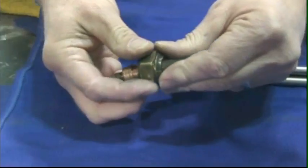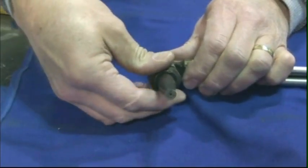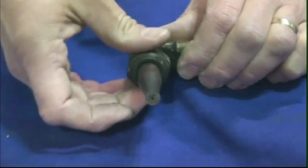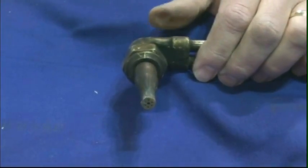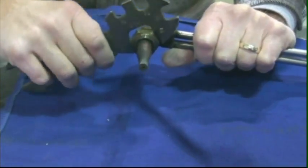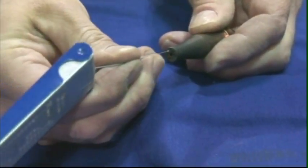The cutting attachment head keeps the preheat gases and cutting oxygen separated during the cutting operation. The outside of the cutting attachment head is threaded for the cutting tip nut. The tapered seating surfaces on the cutting tip provide a metal-to-metal seal when secured by the tip nut. Clogged openings can be cleaned with small round files or tip cleaners.